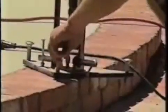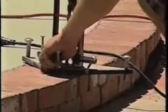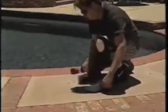Also, be sure your weight is evenly distributed on the base of the drilling guide so that you do not throw off the angle. Repeat this process around the perimeter of the pool. On a step where the guide hangs off the edge, unscrew the feet until the guide sits directly on the surface and drill. Once you've drilled the holes, use a broom and dustpan to clean out the debris. A bit of forced air will help remove the dirt from the hole.